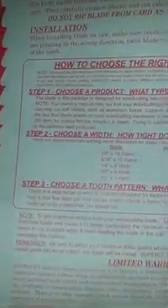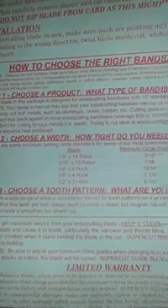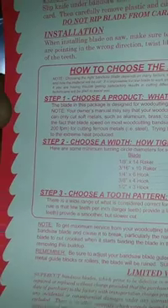That's not slow enough — the recommended range is 40 to 200 feet per minute for cutting ferrous metals, i.e. steel. Mine is a little above 200 feet per minute at 244, but I think if I take it easy on the blade and maybe buy a slightly more expensive quality blade, it will work.